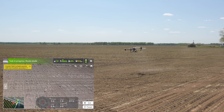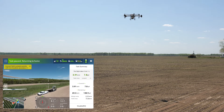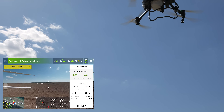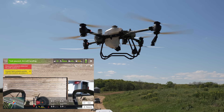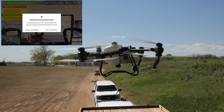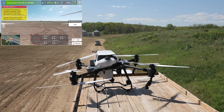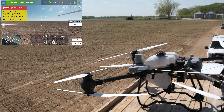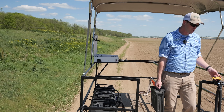I'm going to hit the return home button. It's going to stop spraying automatically and return back home and come down to the trailer automatically. You can see this is new on the T-50 — because of the incredible radar, it can actually spin on the way home to save time, facing the same direction as it took off so it aligns the fill port on the same side. One tank done. I'll grab a fresh battery — we're at 61%, but we like to swap our battery every time to increase redundancy.